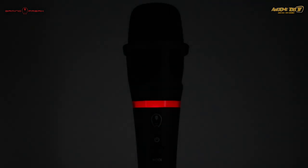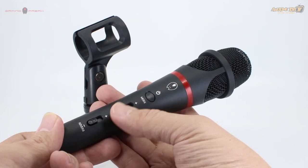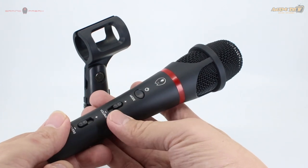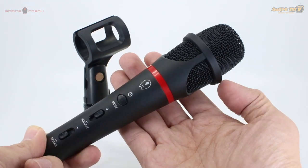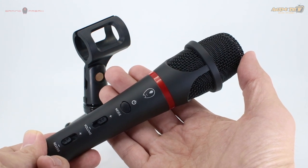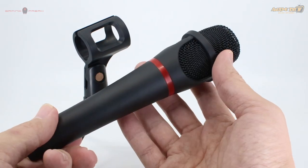There is an indicator light on the mic so you know when it's on or off. There are two sliding buttons on the body — one controls the volume and the other controls the reverb, which is the echo. The third is a press-and-hold button which serves as both the on/off button and the mode button. The mode button switches between effective sound, which is a wet or mixed amplified sound, and ineffective sound, which is dry, direct, and original.